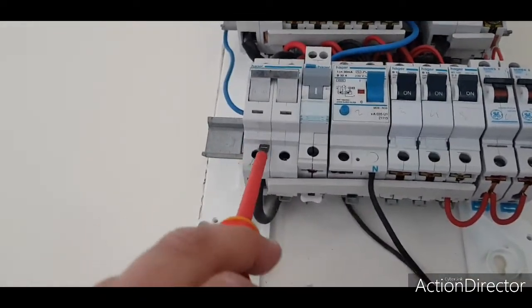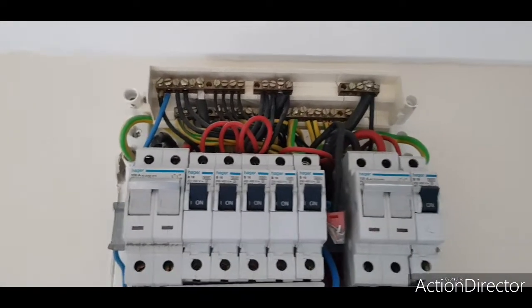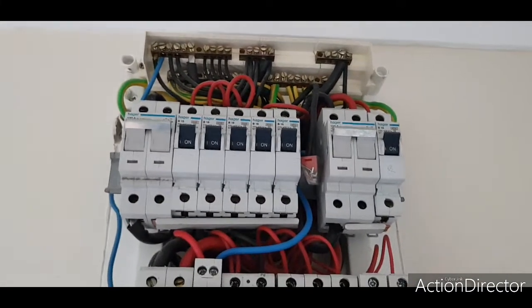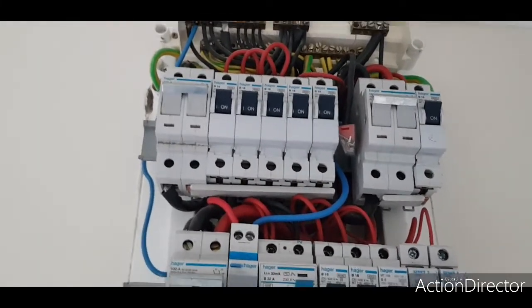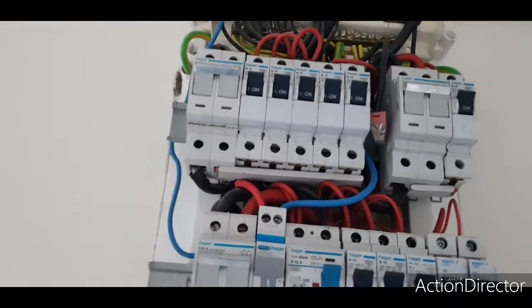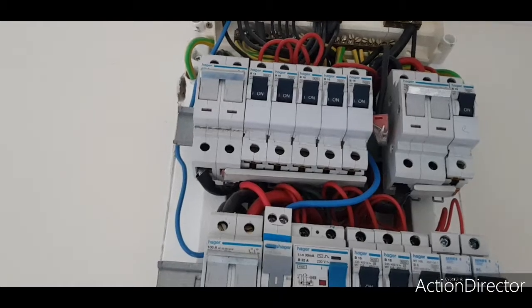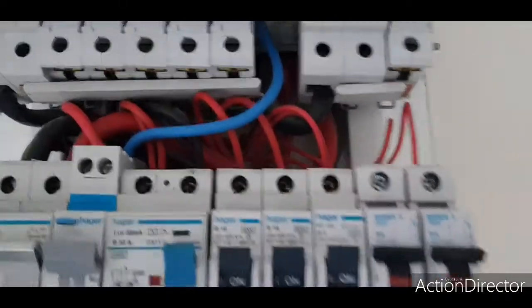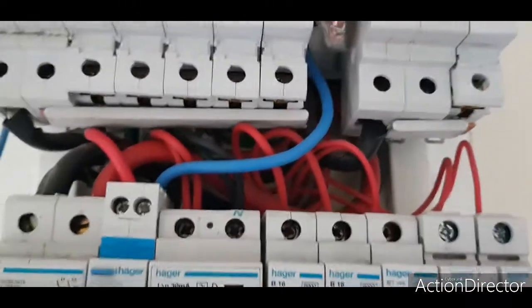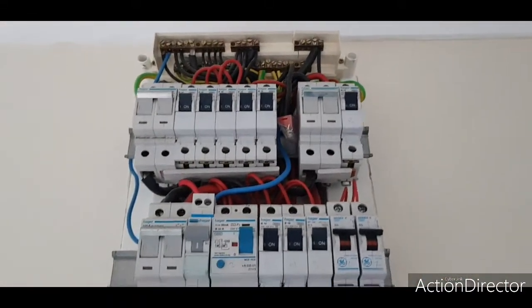So this is going to be changed. We're either going to plan for a single 20 way or 18 way. I'm either going to go with the RCBO configuration or with SPD or dual RCD, but I'm thinking more RCBO configuration, to be fair. So it gives you discrimination of circuits. And there's not even a mixed colour variation sticker on the board either. Or an RCD sticker for that matter. Oh, there you go, have a laugh, haven't you?